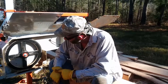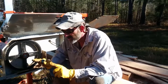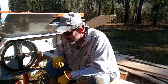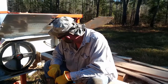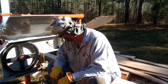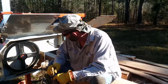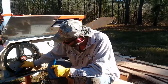always making sure you have your blade tension. We've been babysitting that, and you've seen that that is working well. We've started high, worked our way down, and just skim cut, skim cut, skim cut. Well, as you notice, the blade cleaning system isn't working that great because of the material you're working on, and then the amount of material that accumulates in this sawmill.